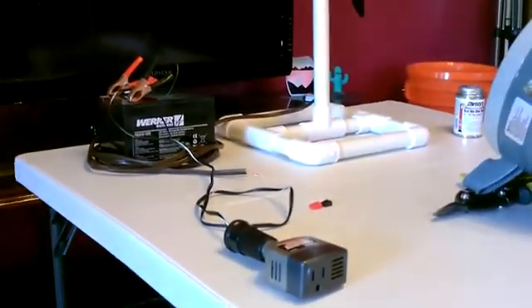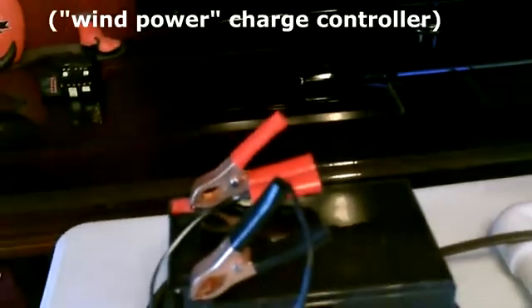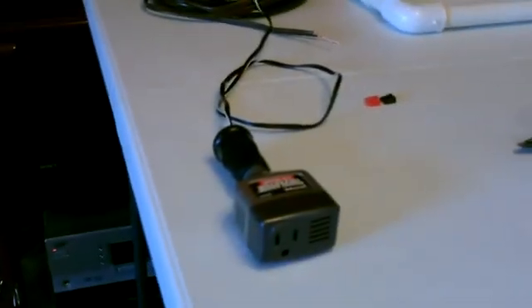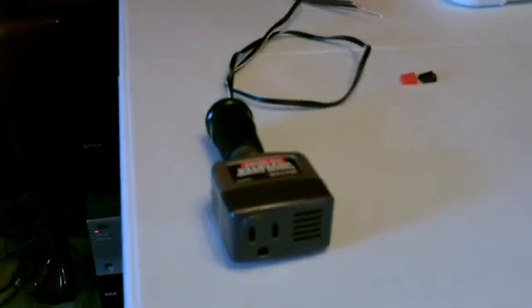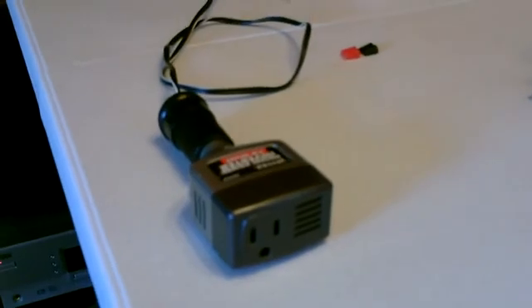The one thing I can't show running right now — it'll have to be a future video. You do need a small charge controller to go between the turbine and the battery. You can't just do a direct connection because the battery just tries to run the motor. So a small charge controller going from the leads of the turbine to the battery. Once you get that, you clamp on a 12 volt socket and you can run things directly off that if you want to do 12 volt DC appliances or lights. If you want to do AC, just buy a small inverter — it just plugs in and then you can plug in regular stuff.